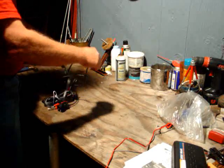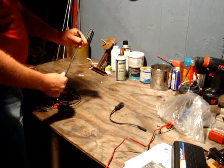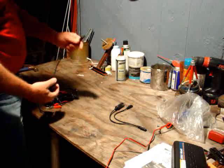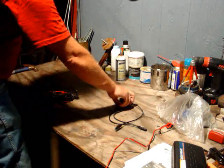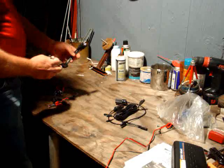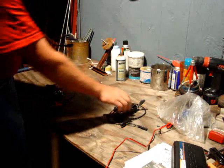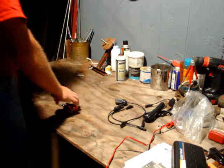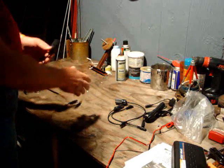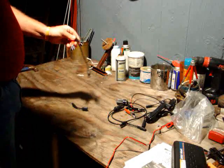We've got a whole bunch of electrical connections here. There's a male plug with a 12-volt connector at the other end, a 12-volt connector with a stripped end, a female 12-volt plug quick disconnect, and the 12-volt connector for that. Then we have an extension with 12-volt quick disconnects. These three go across the back of all three solar panels, since the solar panels have these connectors on them — they link in and go basically to the charge controller and then the battery. This one is for clipping to the battery so you can plug things in and use the 12-volt setup.